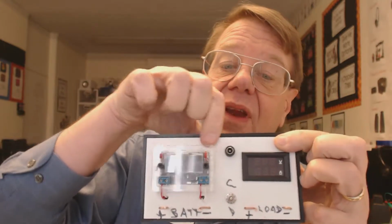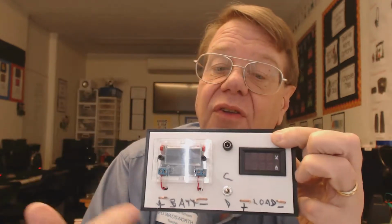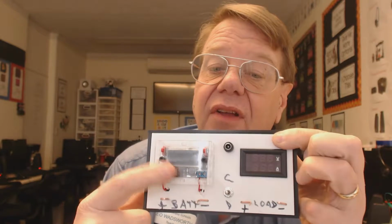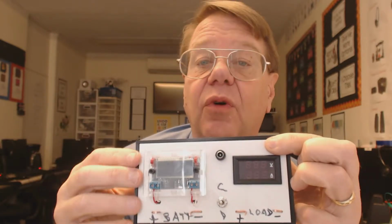The 12 volts comes in there and powers the two meters and also the charging. This isn't just a meter, this is the step-down converter as well that provides the lower voltage that I want for using the batteries. The other thing I wanted to share is I've, of course, already come up with some upgrades to this. You know, nothing is good enough as it is.